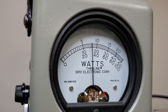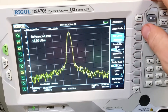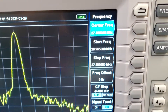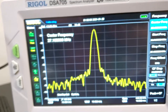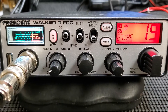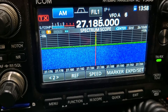Let's go over to the sweep. I'll set this up and make sure everything's on properly — preamp on, arranged so it's showing everything. Over here we've got channel 1, over here we've got channel 40. Start is channel 1, stop is channel 40, center is channel 19. So that's where we're at — channel 19 right there. It's calibrating and looks perfectly fine. The unmodulated carrier looks great. And here is the frequency — right out of the box it's right on frequency. You couldn't get any better than that.